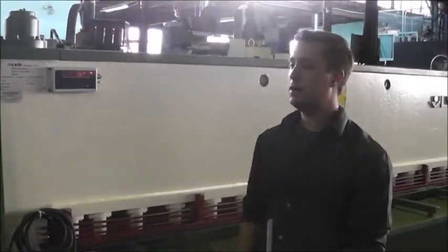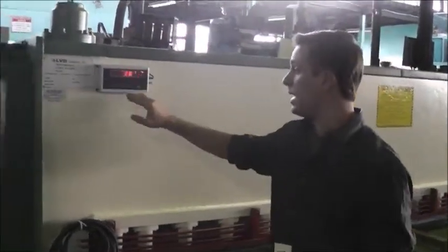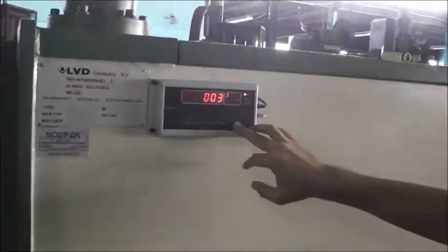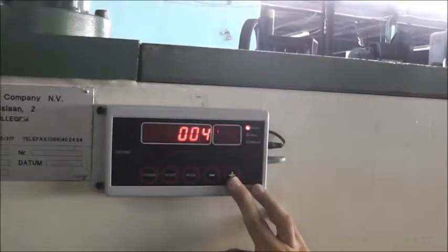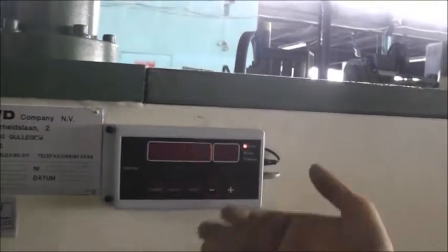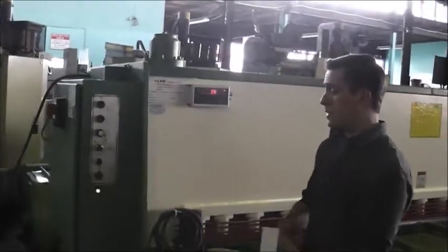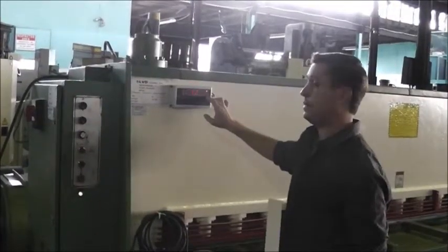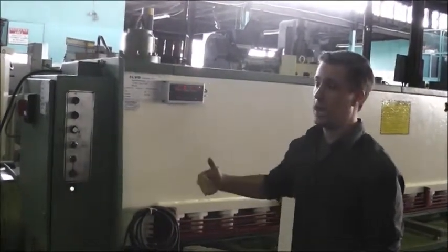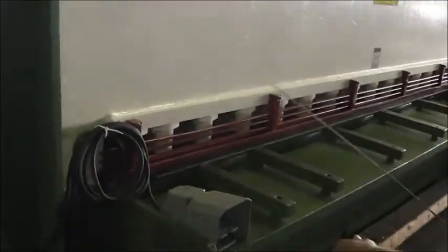We have the power hardwired into the machine so you don't have to use an extension cord — the counter is 110 volt. The first thing you need to do on startup is calibrate the back gauge: find where it's cutting and set the back gauge using the plus or minus adjustment. This doesn't move the back gauge physically — it just sets the readout. If I know it's at five inches, I set this to five inches, and then when I bring it to two, three, or even a foot, it should read that measurement. I'm going to make a sample cut to calibrate.